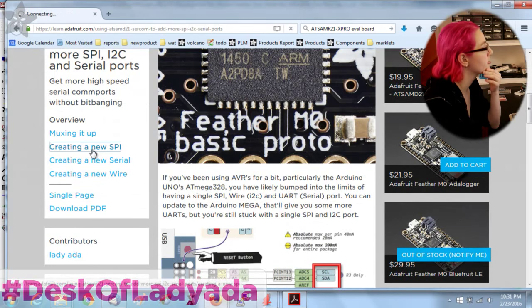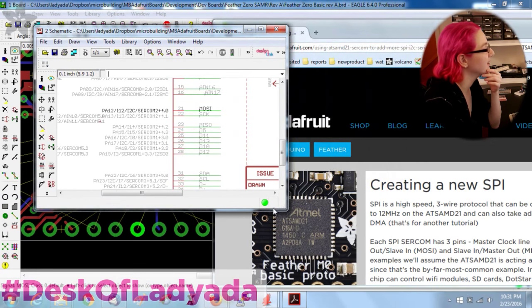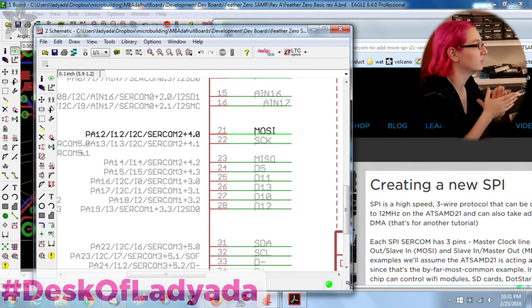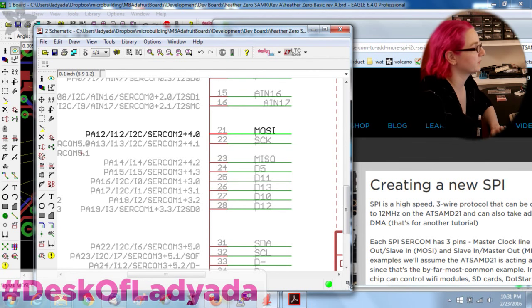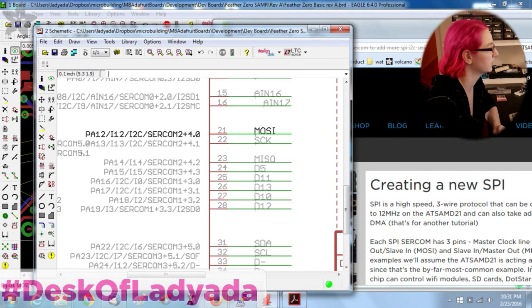Let me see if I can change this pin setup since it doesn't have to be in any particular order. Is there a limit to the number of vias on a trace? I really don't do more than two or three. If you really have a squirrely one you can put like five, but minimize. Once I get to the point where there are too many vias, I clean up that space and redo it — when I do it a second time it always comes out clean.